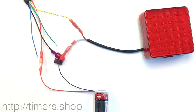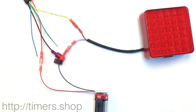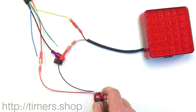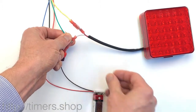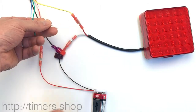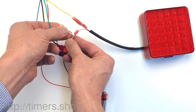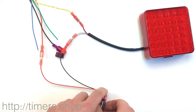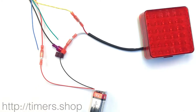So there are the steps to program the timer — really easy. If you need to reprogram it, you go into programming mode again. For example, if we need to change the timing, we put the timer into programming mode by holding the two wires to ground, light comes on. Let's say we need to change T1 to one second or half a second — we just touch the white wire to ground and release. Since we don't need to change anything else, we can just power off and power back on. Now our flashing cycle is about one second.